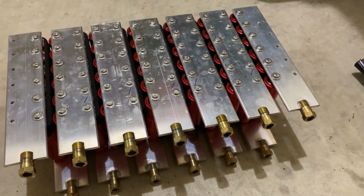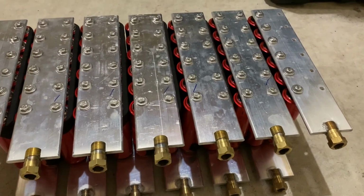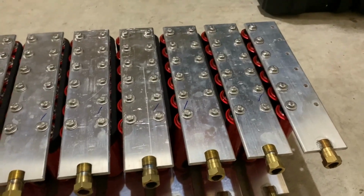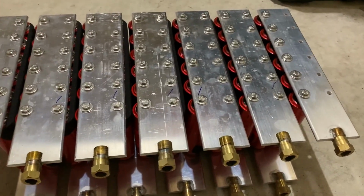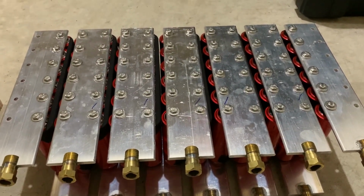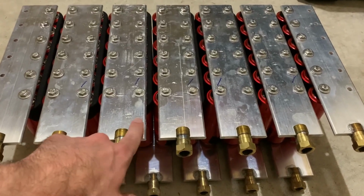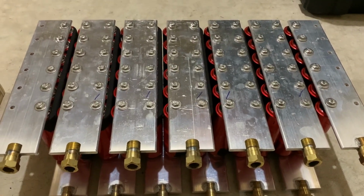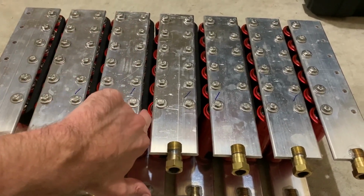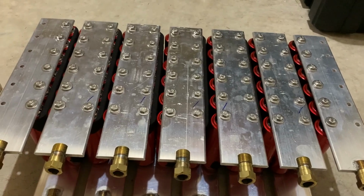After I got done assembling this thing, I kind of got scared of it, because any type of short in here and it'll dissipate massive amounts of power. I think I accidentally welded part of a wrench or a pair of scissors when I was putting this thing together, just from accidentally touching two pieces of metal together. The voltage is not real high, but the current capability is huge. So my temporary solution was some thick electrical tape between here, just to help protect, and not rely just on this thin sheet of plastic on each cell.